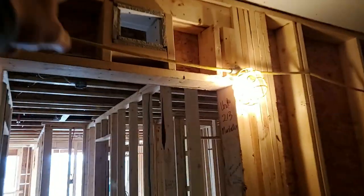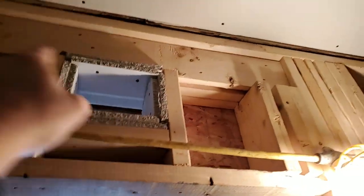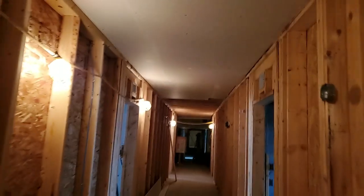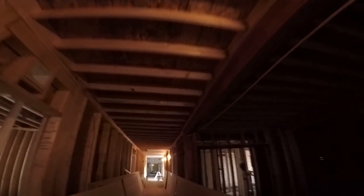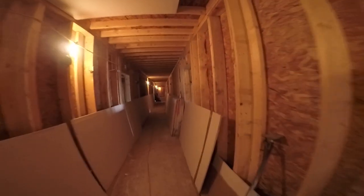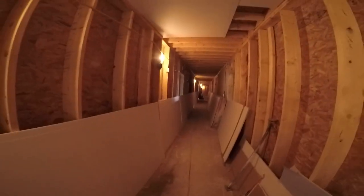We have all these openings for fire dampers. When we drywall over with our strips, we're going to be routing them out — I'm going to use the quarter-inch guide point for that. We're doing the lids on the hallways exactly the same as anything else. Always lay out a bunch of sheets to start so you don't have to keep stopping to load, then screw, lift and screw — you just load and put them on. Simple.